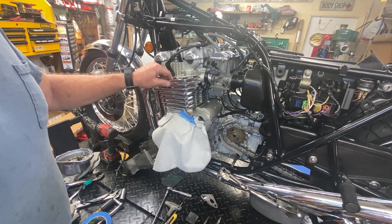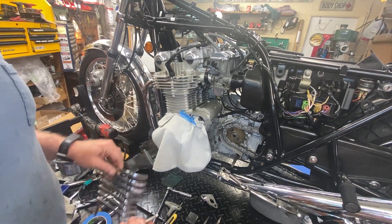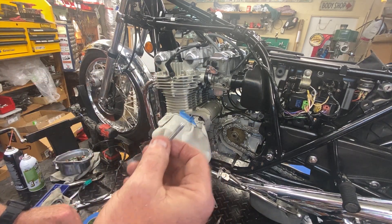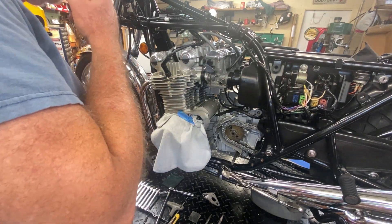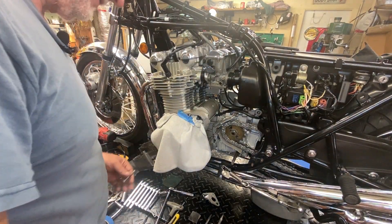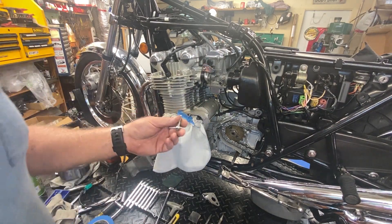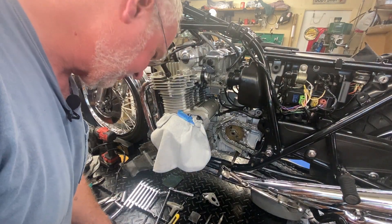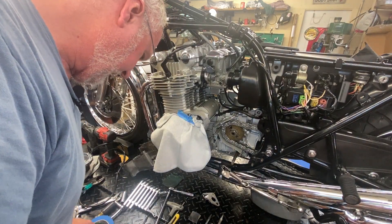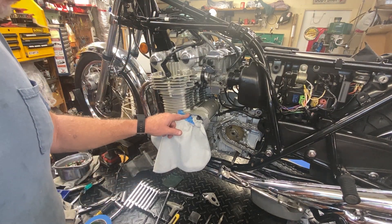It's one of the holes at the top here that holds this heat shield - aftermarket or otherwise. I'm guessing when he went to put this on, the bolt was too short, or it stripped out and he just went to use a longer one. Anyway, I had this all installed, I had the wire run, I was getting ready to button it up and I found this. I was going to use another bolt and I couldn't get any thread in properly - those threads are screwed up.